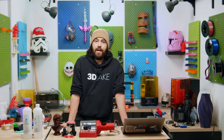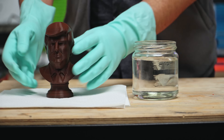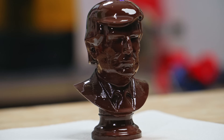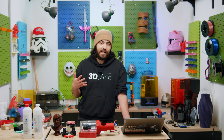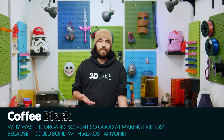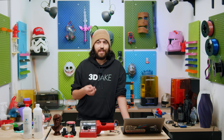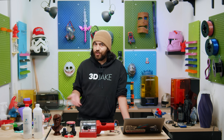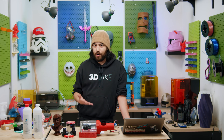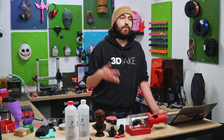A while ago, we rolled out our new ABS to phase out our old ABS, because that was way too dated. What is the difference? Not a huge amount except new pretty colors — except one thing: our new ABS melts in acetone. Old ABS didn't do this; it was geared towards printability and printing without an enclosure. This was eight years ago, when a lot of printers didn't have enclosures and heated chambers were still protected by patent. Things have changed now. Most normal-size printers have enclosures and heated build chambers are becoming more and more common — it's the de facto design almost. So we thought it fit to update our ABS to the modern world.